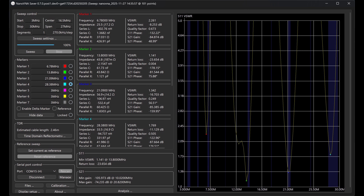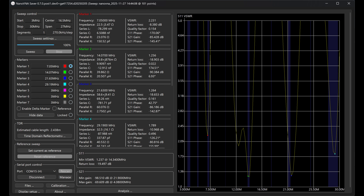The resonant parts looked pretty good — good on 20 meters, 15 meters, and 10 meters. Here's a quick look at the nano VNA sweeps. The initial sweep showed the SWR dips were in the CW portion on 10 meters and 15 meters. However, on 20 and 40 meters, it was slightly below the band edge. I decided to shorten the antenna slightly. On the second sweep, 10 to 15 meters shifted a little bit above the CW portion of the band, but it now looks pretty good on 20 meters and 40 meters.